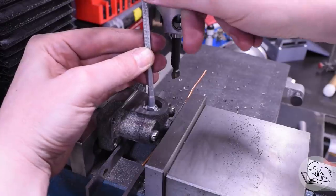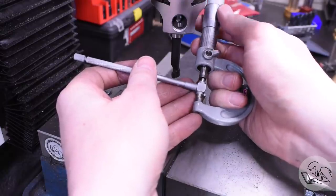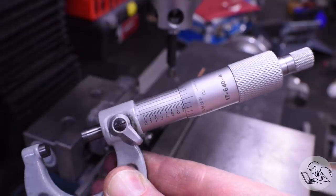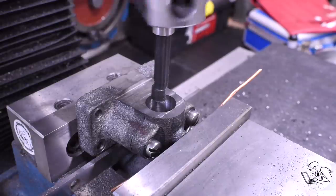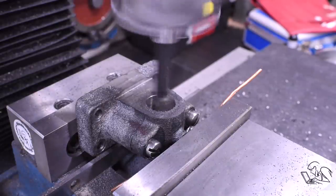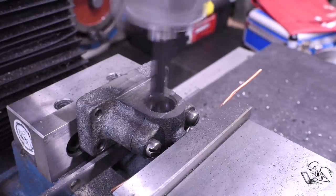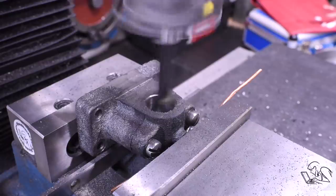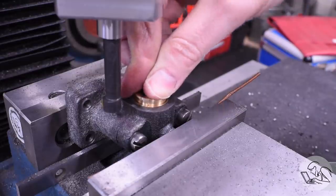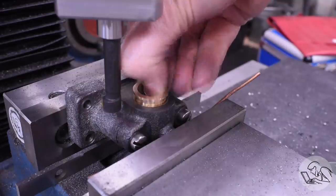Okay, that should be it. I'll check it with my bore gauge - or snap gauge if you want to drive commenters crazy. And survey says - well, would you look at that? Even a blind squirrel hits a dimension sometimes. Now, a little more boring to do though - I want to do a counterbore for the flanges on those bearings. From my mock-up bearing, there's going to be a flange at each end that will center the bearings and keep them in place. That's a very close fit - actually a little bit tight, but my mock-up bearing is actually a couple thou oversize, so it ends up being a perfect go/no-go gauge for this dimension. I brought both bearings to that point, and then I still have to flip each one over and do the counterbore on the other side, centering up each bore with my coaxial indicator.